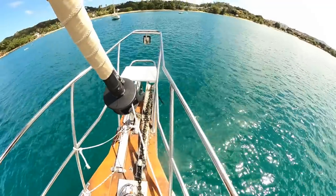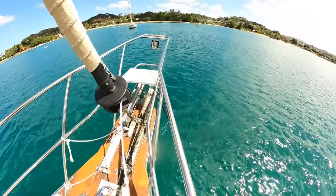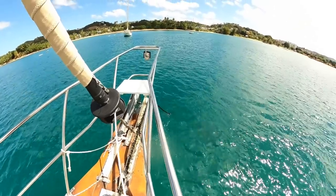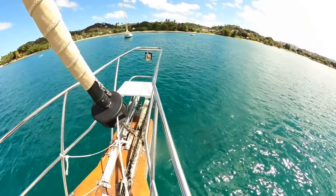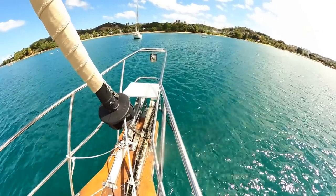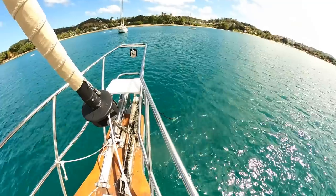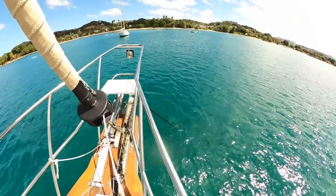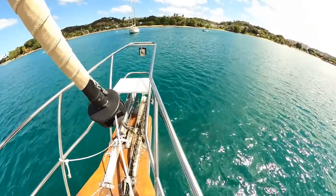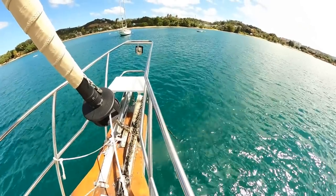Tugboat chain comes in what we call shots, and that's 90 feet. So when we anchor the tug, we'll say like 3 or 3.5 shots. So that'll be 3.5 units that are 90 feet. But because we never anchor in that much water, and we don't have that much weight that the barge does and that sort of stuff, I just do it with a 25 foot marker. So every 25 feet we've got a little marker.